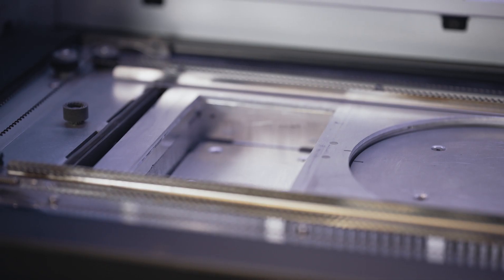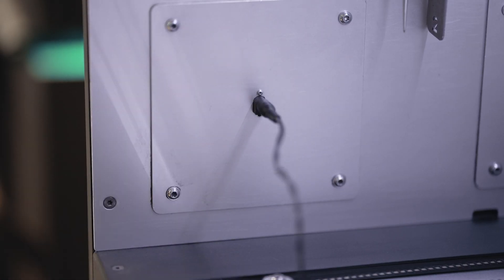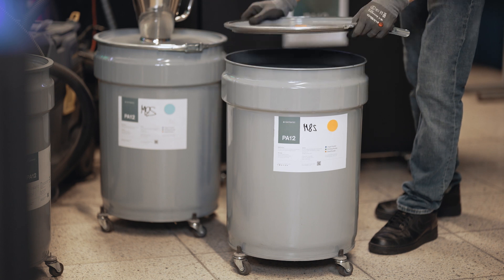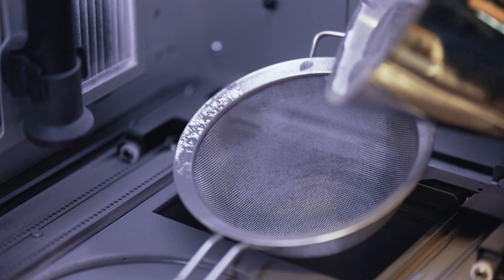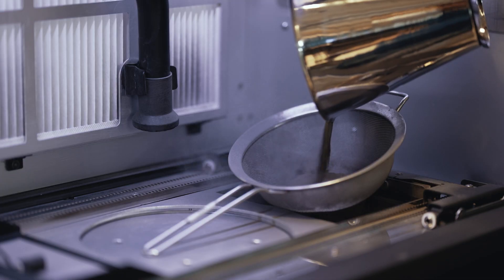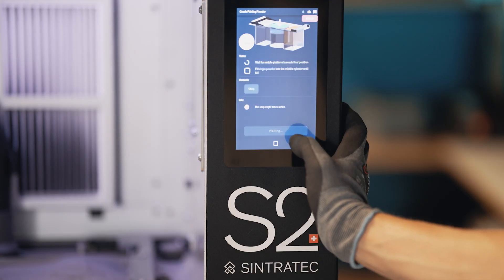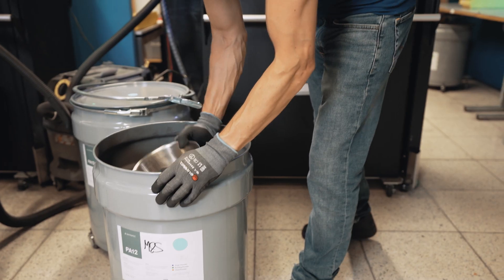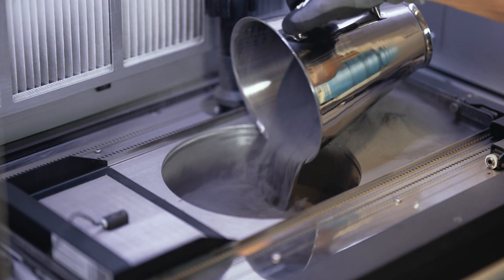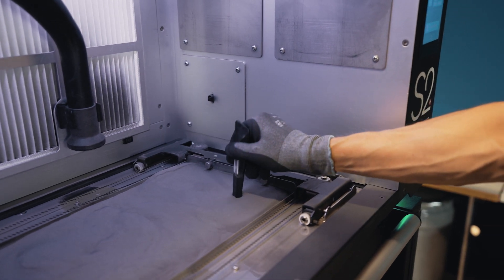While the parts are being post-processed, we mix some printing material again to be ready for the next print job. Push the mixing button to start the process and place the motorized sieve. Fill up the powder container with used powder — make sure you use the Sintratec-provided sieve to avoid large particles. Fill the build cylinder with virgin powder; no sieve is required at this stage. For both, we can now condense the material.